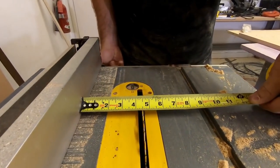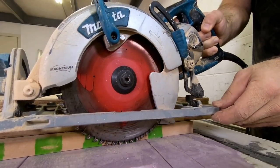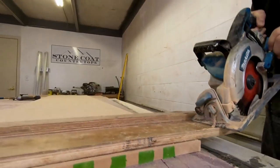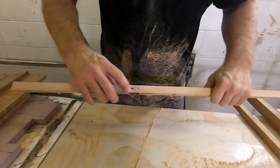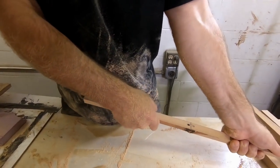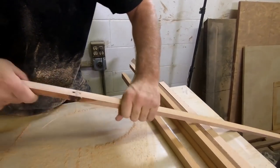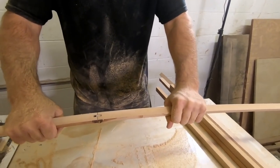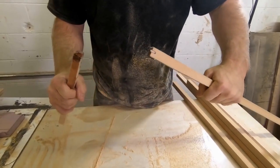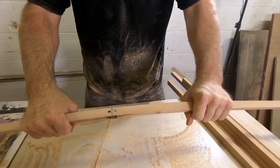We're making a small backsplash piece for this job, cut oversized at four and a half inches even though we only need three and a half — that's a good idea. Pre-gauge your saw off the guide and go just a little bit below your MDF thickness for great finished cuts every time. This cutoff also provided a great strength test opportunity — we wanted to see how well the quick coat bonded to the biscuit and the other piece of MDF.